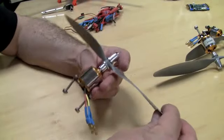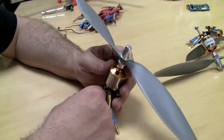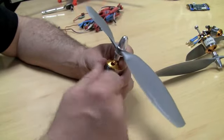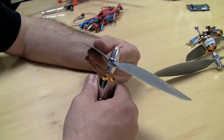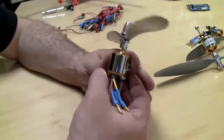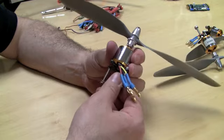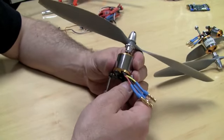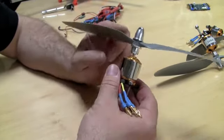This is a brushless motor. You're going to need a propeller and something to hold the propeller on. There are prop savers that use an O-ring, but that can flap around and reduce performance. It's usually better to use some kind of prop adapter or nose cone. Remember to keep the thrust about double what you need — if you need to lift 10 pounds, make sure you've got about 20 pounds of thrust.